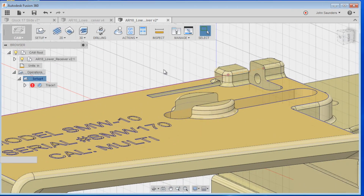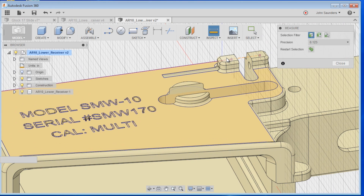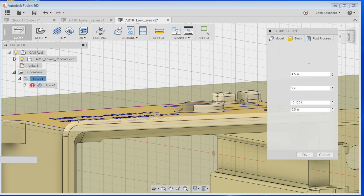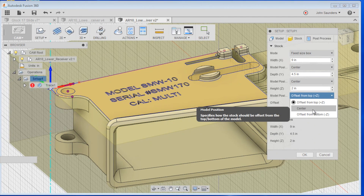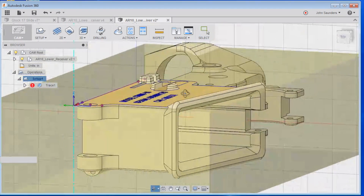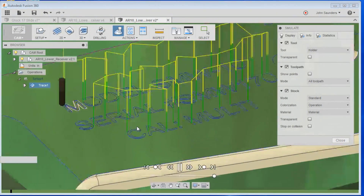Now before we go any further — if we take a simulation look, the problem is we don't have any good stock to work with. One of the really cool things about Fusion 360 is that you can choose the solid as the stock, which is really cool, except it's not going to give us a good simulation because we already have cavities where we're going to be machining that curve. What we need to do is go back and figure out the distance between this height and this plane. Model, Inspect — if we pick this face and hold down Control and pick that face, we see the distance is 1/8 of an inch. Go back into CAM, under Setup right-click, Edit, Stock, do Fixed Box Size. We care about its position — offset from Z Top — and we'll say negative 0.125. Click OK, and that creates a box at the height plane we're working. Now generate the toolpath, go into simulation, click play — this is pretty accurate. It's not perfect, and we should run a test piece especially before you go engrave an AR lower.